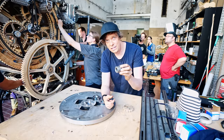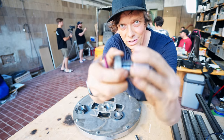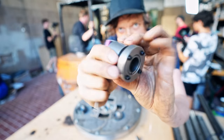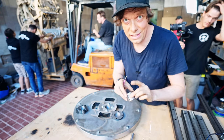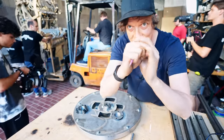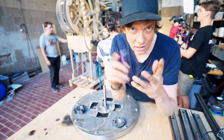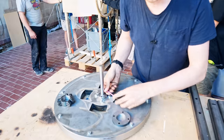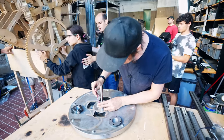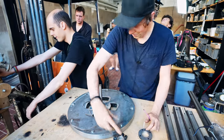Let me show you exactly how a tapered bushing actually works. It's three individual parts and you have a taper on them. When you tighten the set screws, the OD goes larger. So when I insert this in the OD and tighten the screws, the taper bushing expands in the OD and in the ID. Then I can take the shaft and put that in — it slides in really nicely. With just a tiny turn of the screw, the shaft is locked securely to the flywheel. It's completely stuck — super rigidly attached to the flywheel. This is perfect.